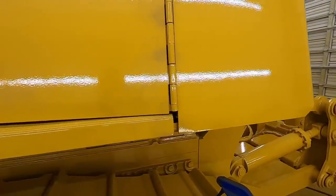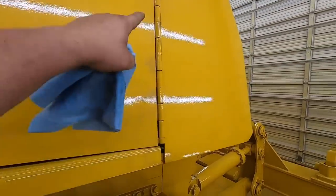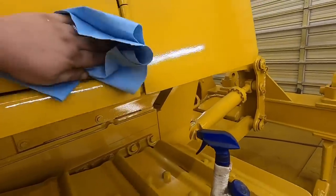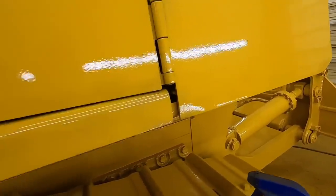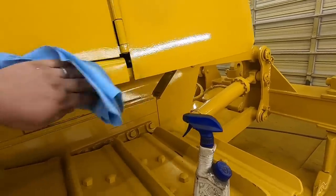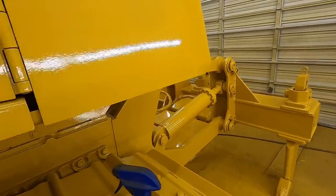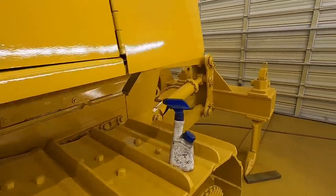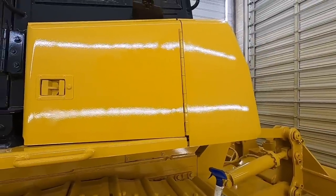And the reason why I like to get my plastic off as fast as possible is for that little ghosting. You see that there? I have some secret magic sauce in my hand. I will give that a wipe back and forth, and you will see before that paint cures, before I'm left with horrible results, I can recover quickly. So I can let anybody tape and mask off with me. It doesn't matter. Even you could come mask with me. But anyways, as you can see, ka-chow, it's all gone.